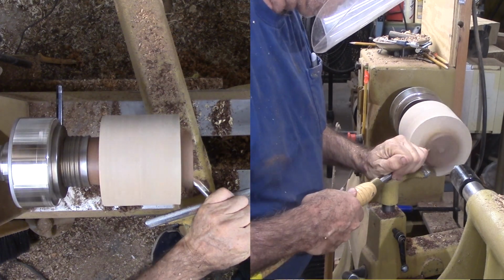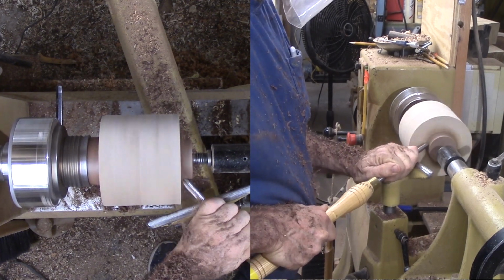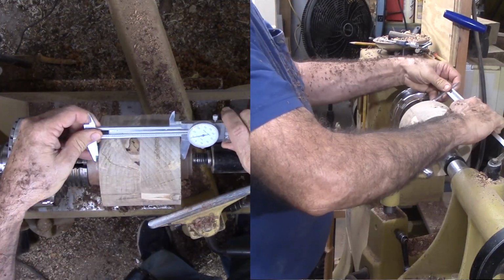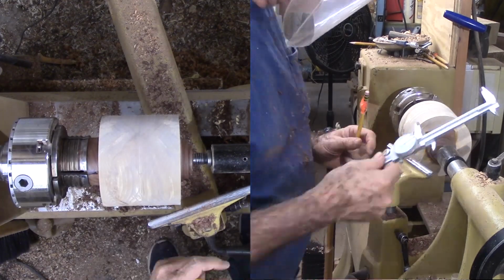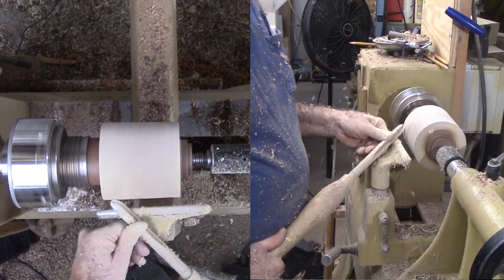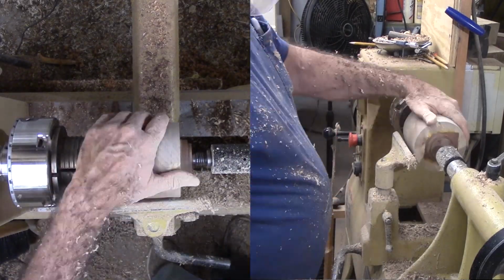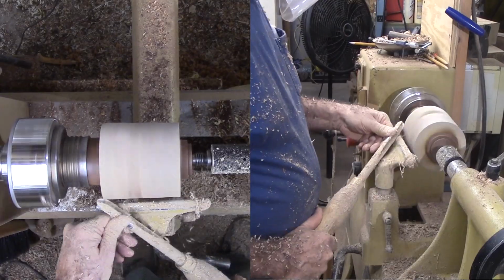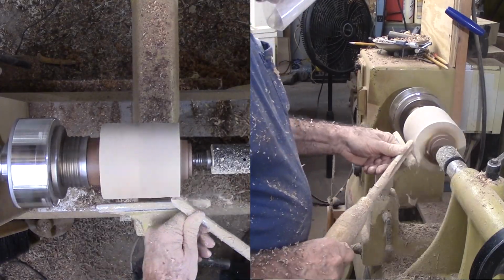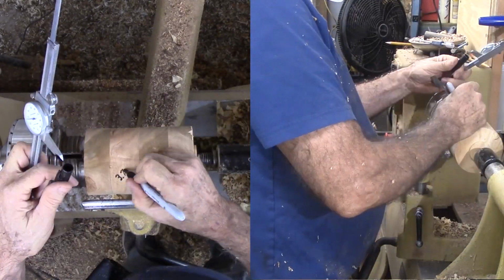The first order of business is to turn the second tenon. Once the tenon is finished, I make sure the length and diameter of my wood is the same. I either reduce the diameter of the cylinder or reduce its length to match. This block is sweet gum. Now I can do the simple calculations for the Octagon method.